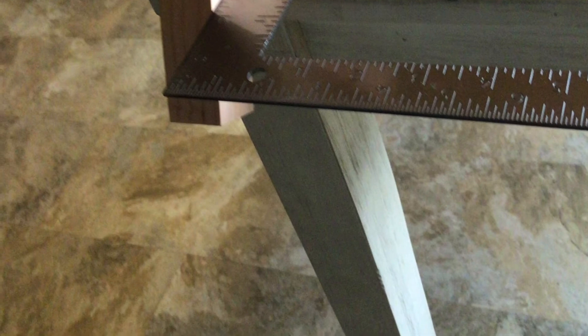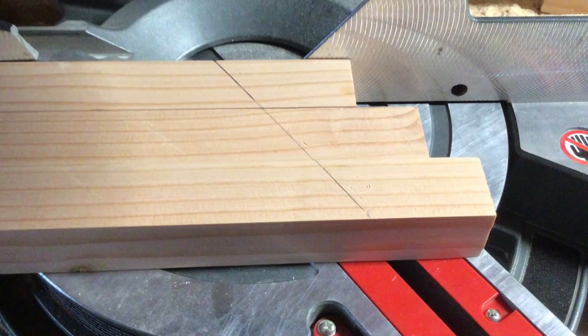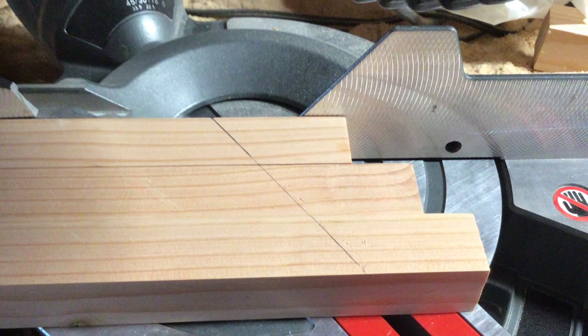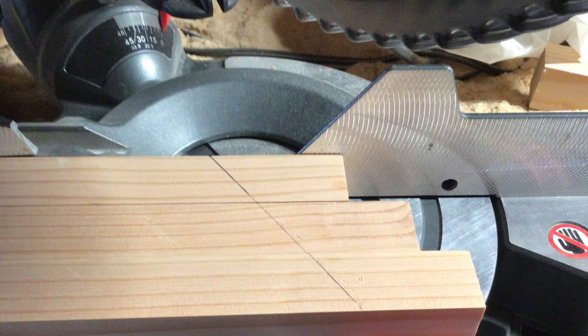Once the top of the deck is at 12 inches on both sides, use your ruler and mark on the legs where that mark is. Make sure that the legs are pulled out all of the way. Take your legs to your saw and adjust the angle appropriately. One of the reasons why we do 15 inches on our legs is that we have a little room to work with. If you're just beginning you're going to want this extra room to figure out your angles.